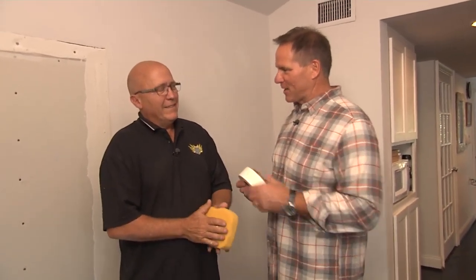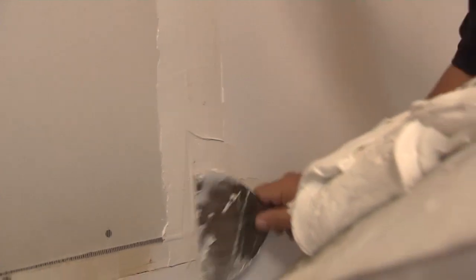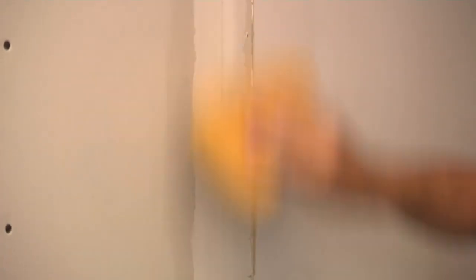I brought in a big gun here for this piece of advice. Joe, you've been a builder for 42 years and you've seen a lot. When it comes to finishing drywall it's probably one of the most important things in your profession because that's what the customers see. Let's talk about a patch and how to get the best results whether it's a big patch or a small patch. Take it slow — get your pieces cut and have it ready to go, cut your fiber mesh tape. It's self-adhesive, you apply it, then start applying your joint compound. Smooth it out the best you can, and after that dries, before you put the next coat on, hit it with a warm water sponge to knock the edges down — you'll eliminate 99% of the dust that way. Just be careful because if you go too deep you can take it all off and you might have to go to four steps. Thank you.